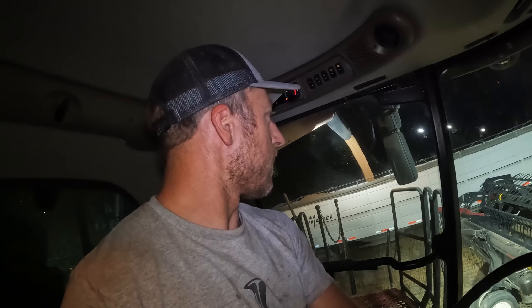Another late one for us. We're shutting down — I'm idling her out while dumping into the truck. I just got it all dialed in and calibrated. It's yielding better than I thought because the yield monitor was way off. Now that I've got it calibrated, it's better than about 20, 22 bushels an acre. That's better.